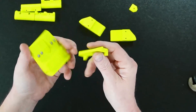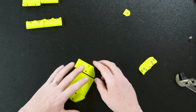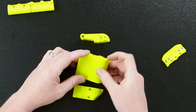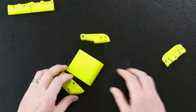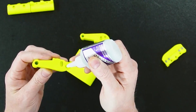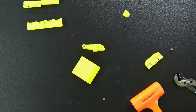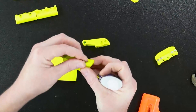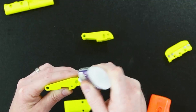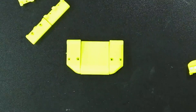That works great until you get situations with angles where you really can't use it, so put a little dab of super glue in each one of those. Let the super glue dry for a minute, then check that your magnets work. There are a couple other magnets that go in here - one here, one here, and on each side. Make sure the polarity is correct on these - put them in one at a time just to be sure. Sticking the other magnets on first kind of helps you check polarity as you go. There we go, all magnets in.